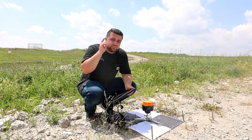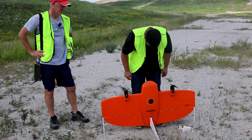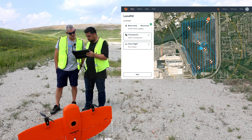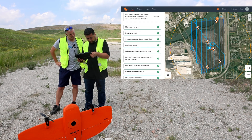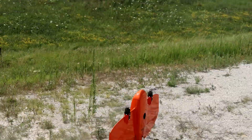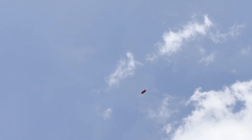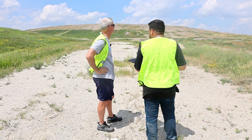Now it's time to pack up the Wingtra Ground and get the Wingtra 1 out and get ready to fly. I'm going to connect up the batteries. Let me just make sure this is exactly what we need to fly — looks like you've got it covered. So now all we're going to do is click drone flight — this checklist is telling us that all of these parameters are good, so we can upload the flight to the drone. Everything has been uploaded, we'll say start flight, step back, and slide to confirm. The drone is doing a circular path — you can see it way up in the sky. It's going to head over to the start of its flight line, covering right around 400 acres at about one inch per pixel resolution at 400 feet.